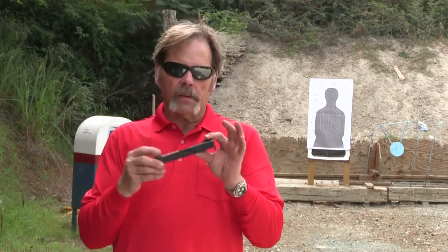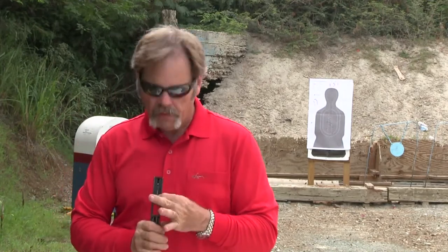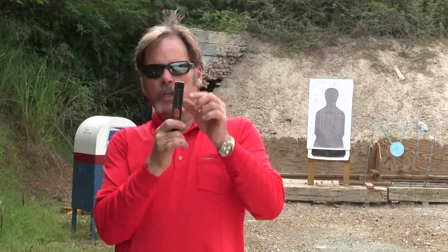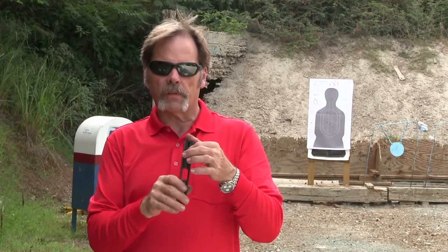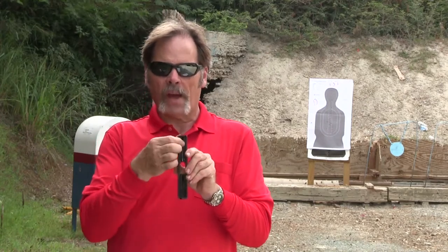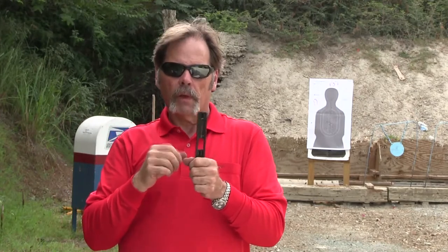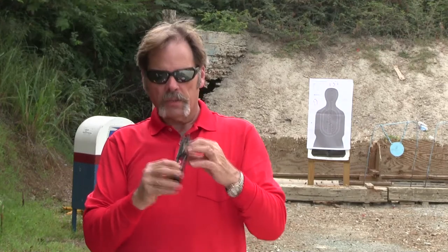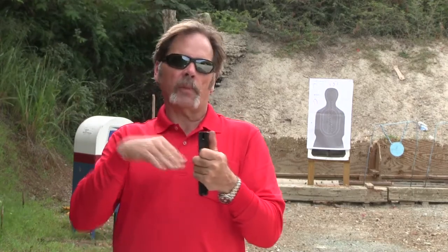Now I'm going to inspect the slide. I'm going to point the slide nose down, push in the firing pin safety, and the firing pin should go forward — which it did. I can see the firing pin nose sticking out of the breech face, so I know the firing pin safety is releasing the firing pin. Next I want to make sure I don't have push-by, so I've reset the firing pin and I'm going to push on it to make sure it won't go down with the safety in place. Then I'm going to push the safety in and rattle the slide back and forth to check that the firing pin has free movement.